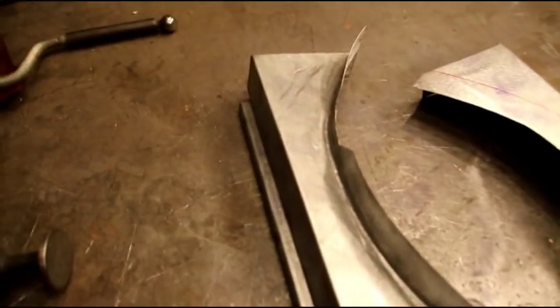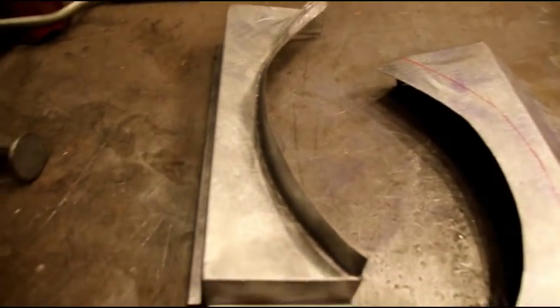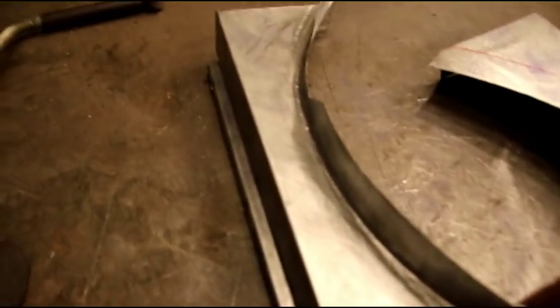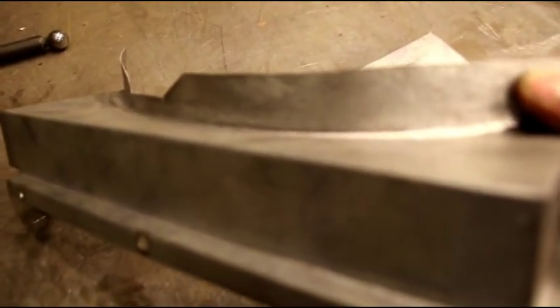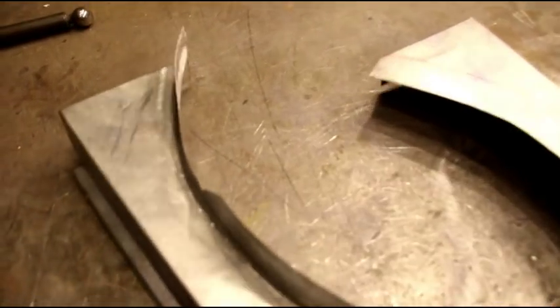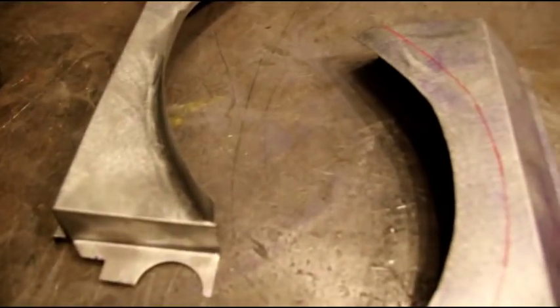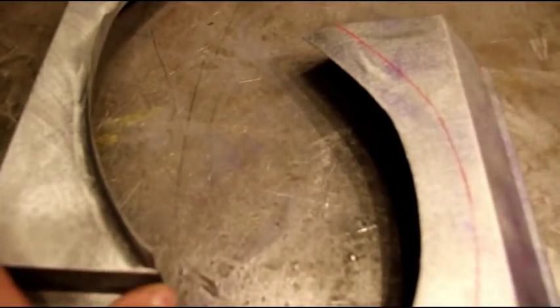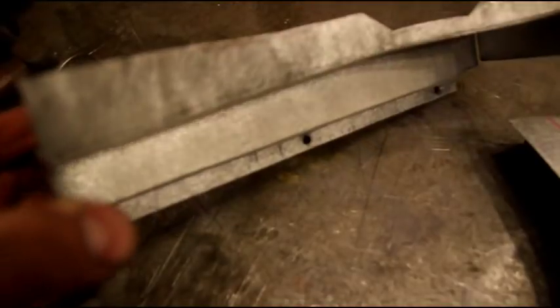And when you have thin sheet metal and you got to come up with a flange like that, coming up with that's an inch and a quarter flange, it needs quite a bit of stretching to get up to that 90 degree without distorting anything. Thin sheet metal and stretching is kind of tricky because it doesn't take much to damage it or tear it or anything. I did that in the planishing hammer with some stretching dies.